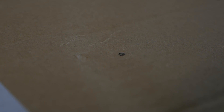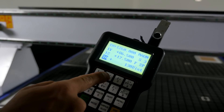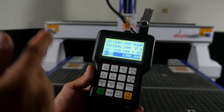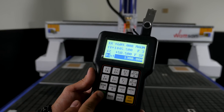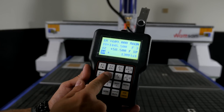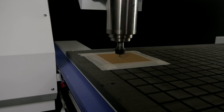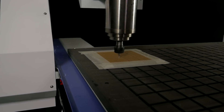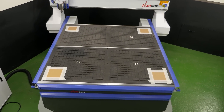Always remember that you have to switch the mode, move with set distance, and then make the next hole. In this example we are working with the M1-1616, so on the remote control we select a distance slightly smaller than our field but so that the cutter always hits our glued pieces of cardboard. Thus we make holes from all four sides of the working field.